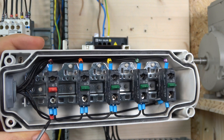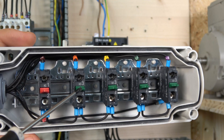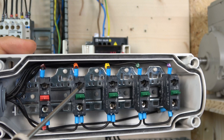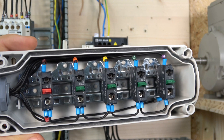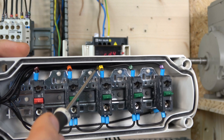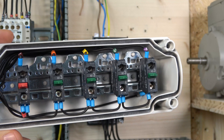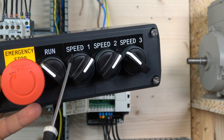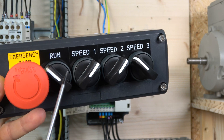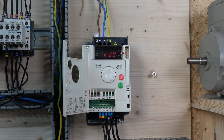For the wiring: a 24V signal comes into the E-stop, powers up all four normally-open contacts. The run signal is one contact, and then from the panel you activate run — the frequency stays at zero until you select a preset speed. For two preset speeds use Digital Input 2, for four speeds use Digital Input 3, and for eight speeds use Digital Input 4. The station has a run button, speed one, speed two, and speed three.